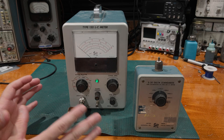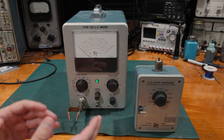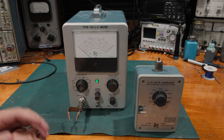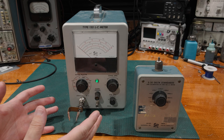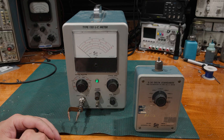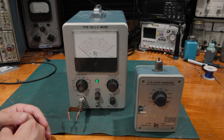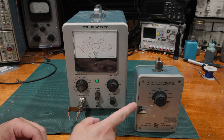That is a mild oversimplification. For things like resistive and capacitive standards, we have some of the best high-quality capacitors and resistors we could make, and these are the standards — but ultimately they're physical devices and they do drift over time, so they need to be monitored. That's not what this thing is.